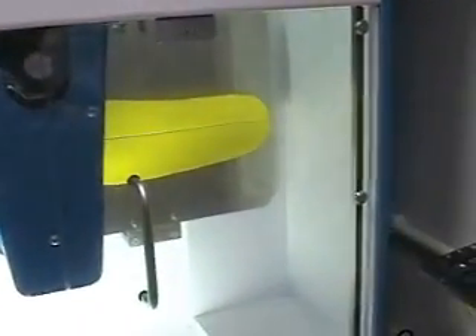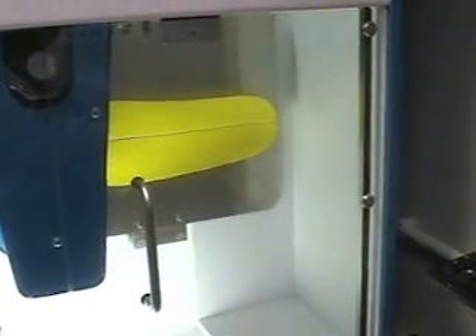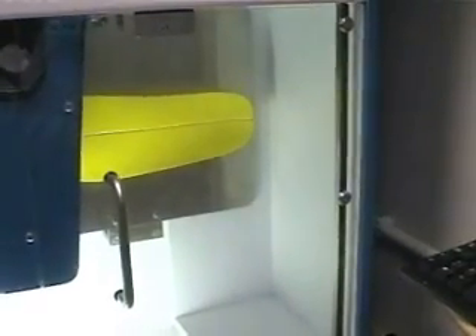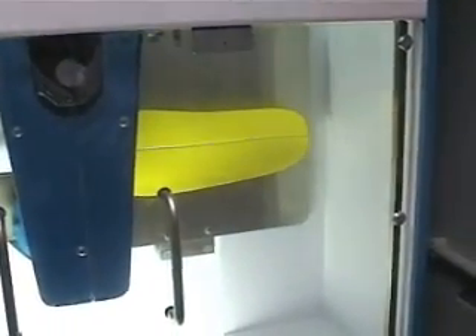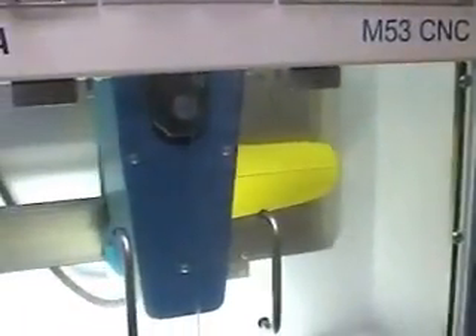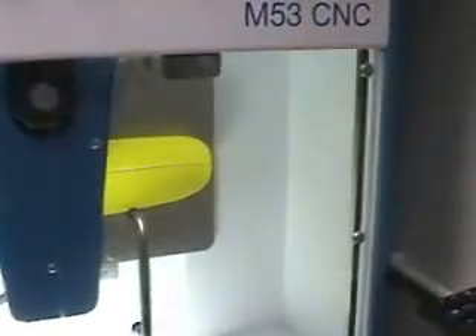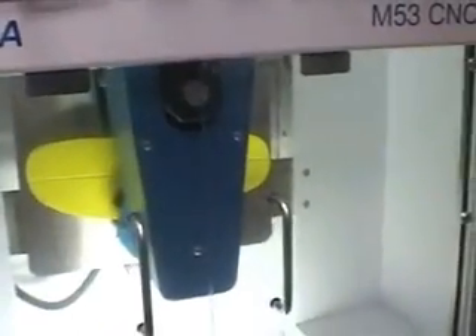I think what we were doing — it was going to run on extra slow, which is best for milling cork blanks. But because we're milling a medium density, we can run it on fast or very fast. This left-hand blank, we're running on fast, so it ends up being about eight minutes a side. Very fast I believe is about seven.